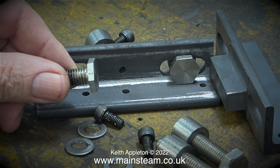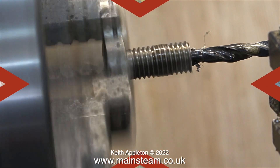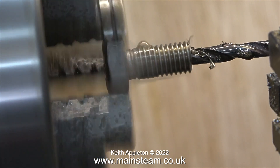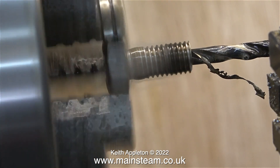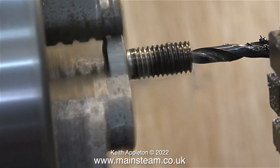Especially when you're machining stainless steel, which can be quite difficult to machine as it work hardens very quickly and gets hot. Here's a clip from the previous episode — you will notice that I've put a red cross in front of the clip, which means do not do it like this. For this application, which is not a high tolerance part, it's actually okay.